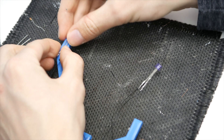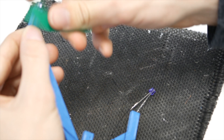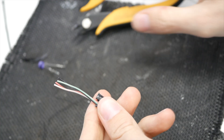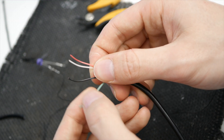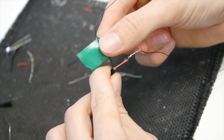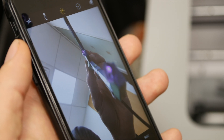Attach the LEDs onto your structure by means of hot glue, tape, or just whatever you have — one LED per arm. You'll be left with two ends of wire coming off your structure: your positive and negative. For this step you'll need a sacrificial USB cable — any cable will do as long as it has a USB male connector on one end. Splice your cable; you'll find there are four wires inside. It's the black and red wires we care about, so ignore the other two and just expose the black and red. Solder the red wire to positive and black to negative, then isolate those two wires with electrical tape to avoid bad things. All that's left is to plug it into your PC and hope you haven't screwed up the wiring enough to blow up your USB port.